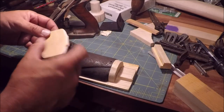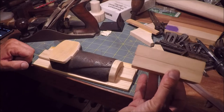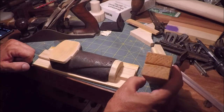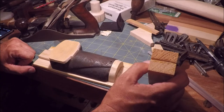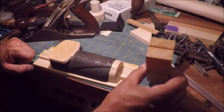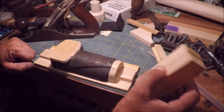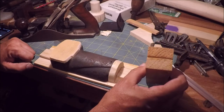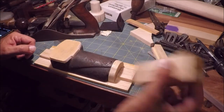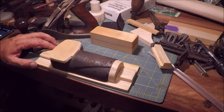To do that, I have two three-quarter inch pieces of pine glued together making an inch and a half square. I put a piece of craft paper in there - like your brown paper bags from the grocery store. I'll be able to put this in the lathe and turn it into a cylinder, then put a chisel on there and pop it right apart. I'll have a really nice half-dowel that I can glue on to make the rest of my core print.